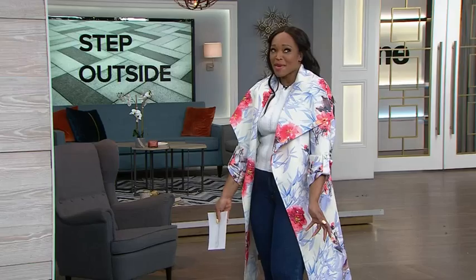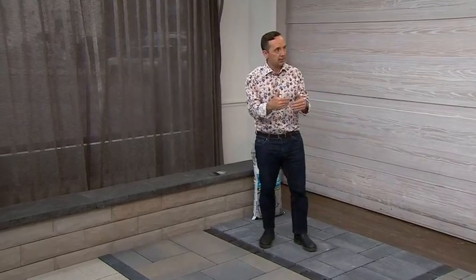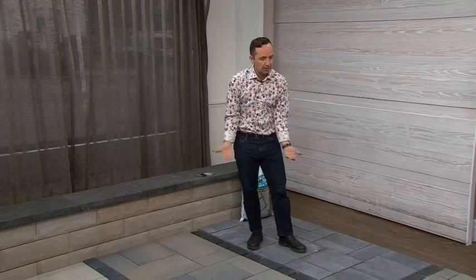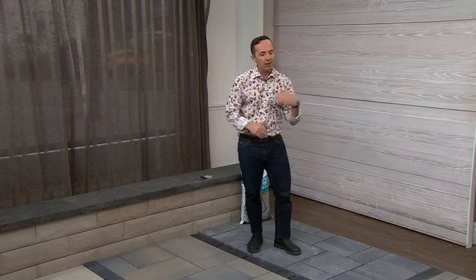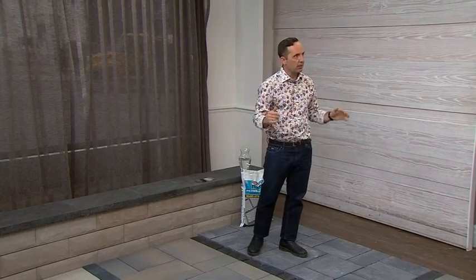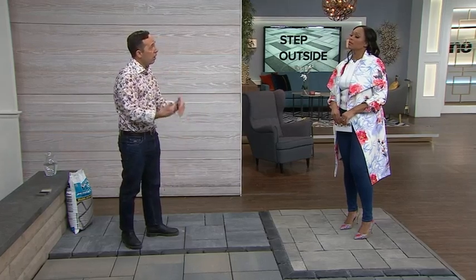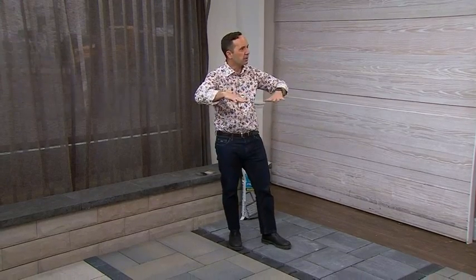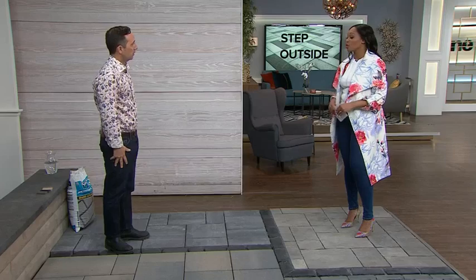First off, do you want to do it yourself? If you are a weekend warrior, you can do this, but there is some technique that needs to be really considered. There's a lot that really has to do with underneath — the soil that's underneath — and making sure that you have a really good foundation and base. Even when you're hiring a contractor, you've got to make sure that they dig out the area, that they're putting gravel down, and they're putting a good base layer down to lay the interlock patio on top of. The reason for that is we want water to flow through. What happens when water freezes underneath in the winter? It's going to crack, heave up and down. The stones are going to crack.